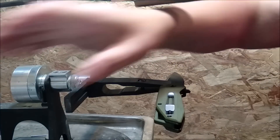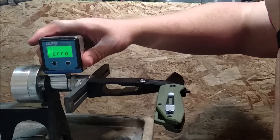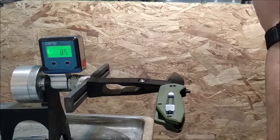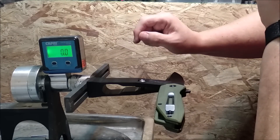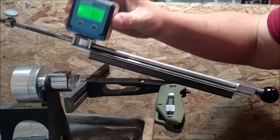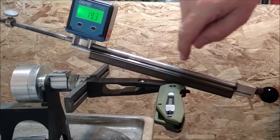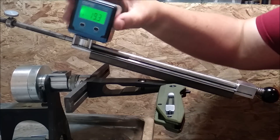The way I can do that is I take my angle finder, put it on this flat spot, and zero it out. On that flat spot it's zero, and if I put it down on here and measure that angle, now I'm measuring the angle down onto the knife — that's at 19.3 degrees.